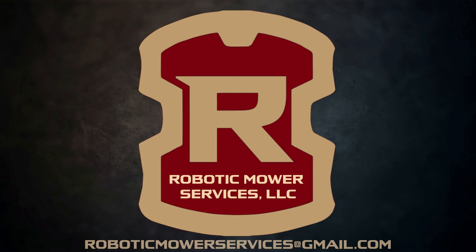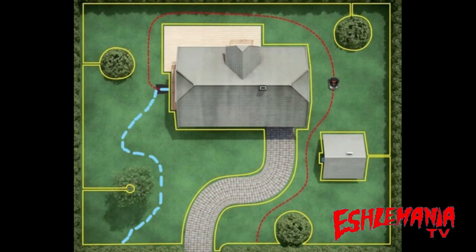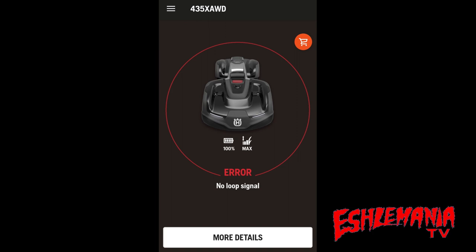It doesn't mean we're going to stop putting stuff here on this channel — we're just going to make it easier for you to find it on the Robotic Mower Services channel rather than being mixed in with everything else. Back to locating your wires underground. This is good information to know because it's going to save you a lot of time and money in repairs. If you're out there excavating and cut your wire in several places, or if somebody comes in to aerate your lawn, that wire is going to be like Swiss cheese and will just have to be replaced.